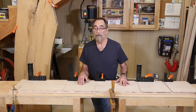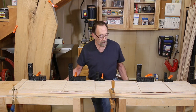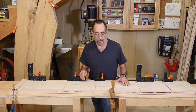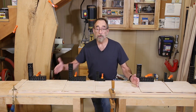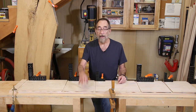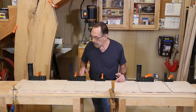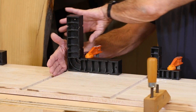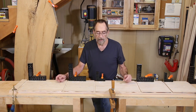This is my third attempt to dry-assemble the large set of bookcases. I've taken the bases from the I-beam work support project, laid a piece of three-quarter-inch plywood on top, leveled everything up, and put one side down and clamped it into place. The idea is to stand the shelves up in their respective dados and then put the other side on top and clamp everything together to get a dimension for the back. To assist, I've got corner braces clamped with the edge right next to the dado edge, so when I put the shelf in I can clamp the square to the shelf and keep it from rocking or falling out.